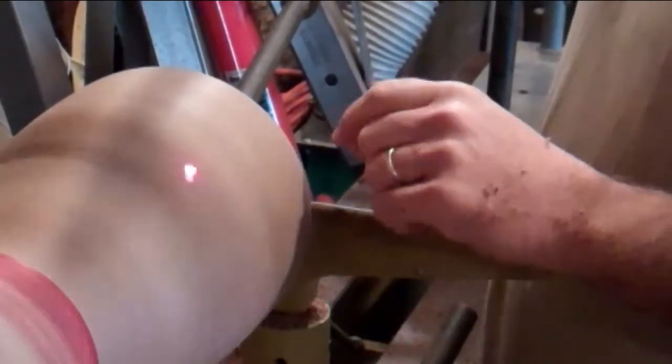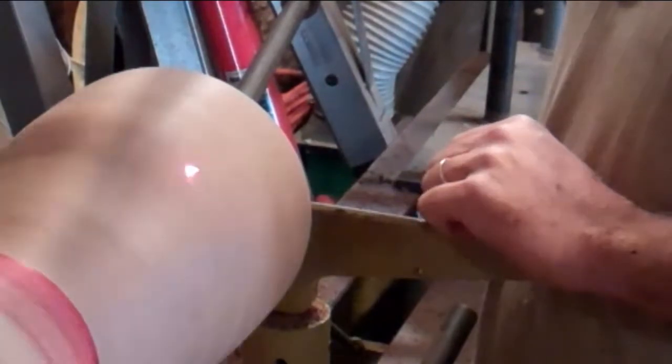In years past, I didn't have a laser, I didn't have the bar, I used the hand chisel, and you can only go down so far with a hand chisel without it just being too much vibration due to the length and just not enough support. But I would do it. I'd have to stop every minute or two. I'd cut a little bit and then stop and use calipers to measure. That's the old way, which is a great way. That's the way I learned. But with the Jamieson bar and the laser, it's harder to go wrong.